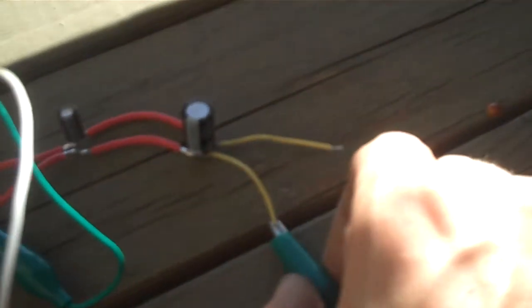These capacitors are large enough, and this is such a low load being tested, that when I disconnect and remove all the power going from the panel to the circuit, it still has power. That's because these capacitors are basically little batteries holding the charge and discharging it. Since this is only testing voltage and not taking much from it, it will drop very slowly. I just charged it up again — popped it in the sun — and we're at about 21.8 volts, slowly discharging.